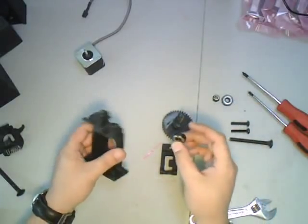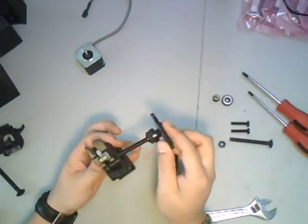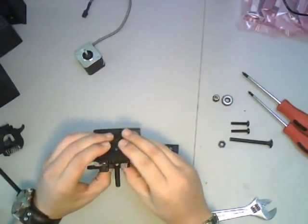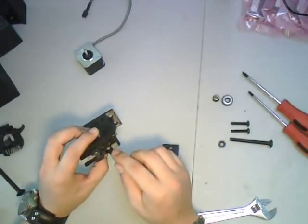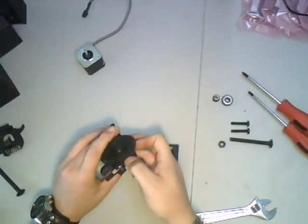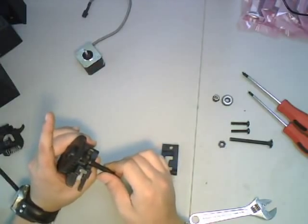You take your filament feed drive body; another 608 bearing press fits in just like that. This whole assembly then slides in and fits in. It might look like it's just sitting in there but it actually is captured, since the nut is a slightly smaller size than the actual bearings — it sits in a smaller opening inside and the bearings can't pass either way.